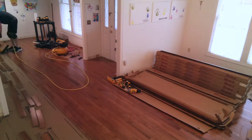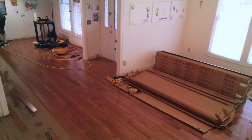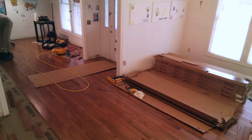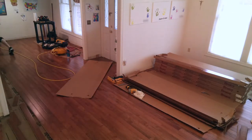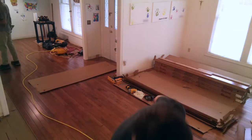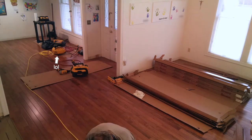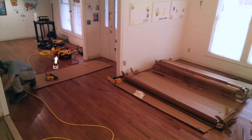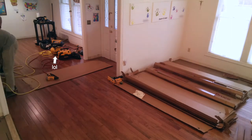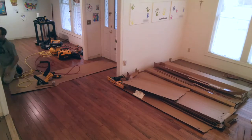Here I am going through as fast as I can. It's best to lay out two or three boxes worth of wood and then pick and choose to make sure that your seams are all pretty staggered so it looks random. Otherwise you get weird-looking stair-stepping patterns and your floor can come up a little more. Another important thing is to make sure you have a three-quarter inch expansion gap — at least that's what it is for this three-quarter inch hardwood — around all the walls, to allow the wood to expand and contract without bowing up or cupping.